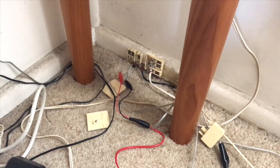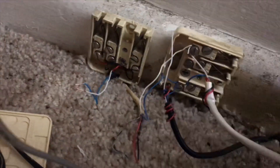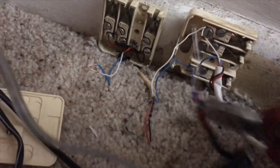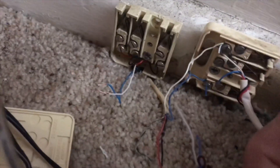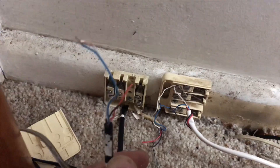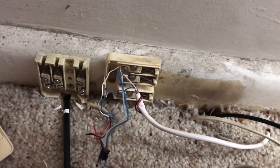Now I'm going to show you what we need to do to get this existing Optus cable house working with NBN FTTC. First thing we want to do is remove the Optus cable. Now it's separated out from the rest of the internal cable. We've disconnected the Telstra leading cable from the socket, and we're going to move it over to the other socket, then disconnect the Optus leading cable.